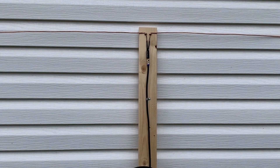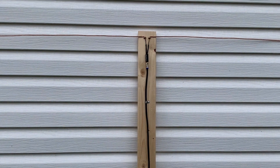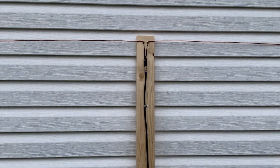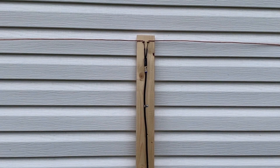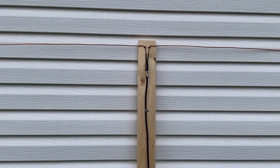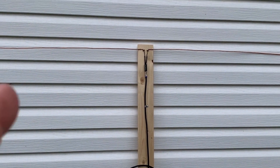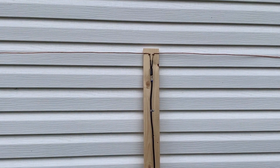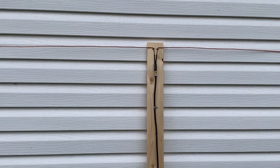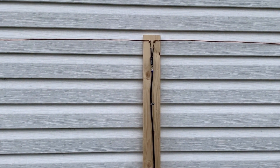These elements, given that they're about 64 inches in length, actually put them somewhere in the FM radio band if you want to get technical, but they are plenty long enough to receive the TV channels in my area. I have three channels that broadcast on the VHF band — low VHF channels 2 and 4, and high VHF channel 9. If I were to cut this for RF channel 2, the elements would need to be about 8 feet long in total, which would be problematic with wire because they would just be sagging and drooping all over the place. Plus, this was the wire I had laying around, so this is what I went with.